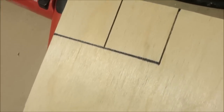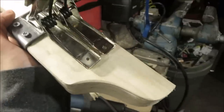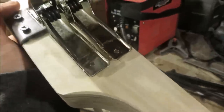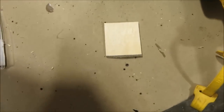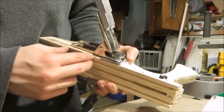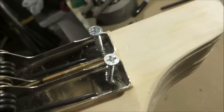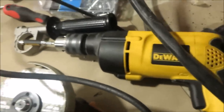Now that we've got all this stuff screwed in, we're just going to plug up these little gaps here using some little three-millimeter plywood rectangles. Quick tip: I would suggest drilling these holes out before you do the riveting up here, because it's kind of awkward trying to slant the drill and get the drill bit to catch inside the space. After you get those holes drilled out, take your little plywood rectangle and wedge it under there with some wood glue — put the glue right here and as you slide the piece in, it'll spread the glue out. Then clamp it up in the vise for about 10 minutes. I used a hammer to set the screws a little bit just so they're easier to work with, and then put them in the rest of the way with the drill.